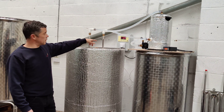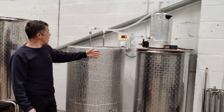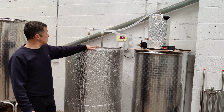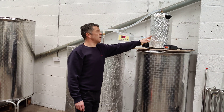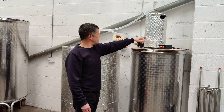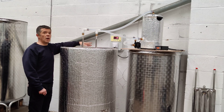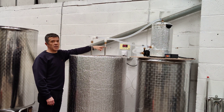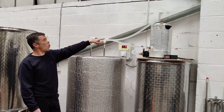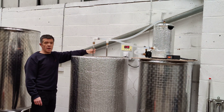So it's only at 11 degrees. Now there's no liquid in the tank — it's just empty for today's demo. But in usual circumstance, what the process that follows is: because the contents of the hot water cylinder is 30 degrees and the current internal temperature in the fermenter is below the target of 30 degrees, the pump is active and it's pushing the hot water through the plate. And you can feel the warmth in the plate.